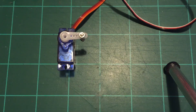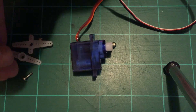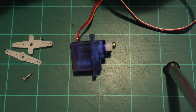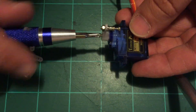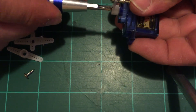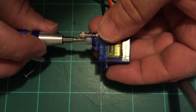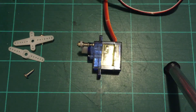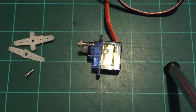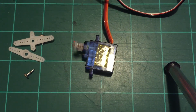All you have to do is grab your servo screw, which will be in your little bag of parts. I'll take it and put it on my screwdriver, which has been magnetized, and go ahead and screw that down — we're just going to snug it. We don't need to over-tighten these because you can strip them out very easily. There's our servo with servo horn — low rate, high rate — and with full throw, it's not even touching the case anywhere, so we're good to go.